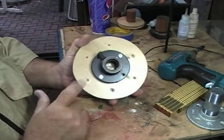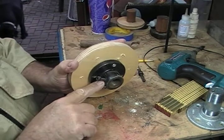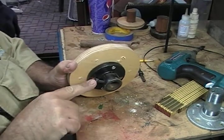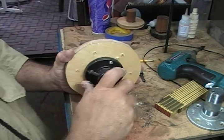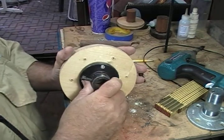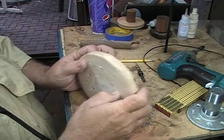The bottom half of the chuck starts with a faceplate that fits my spindle, which is 1-inch-8 on this lathe. I drilled a hole in it, tapped it, and put a set screw. This is important because when you're running out of round, if you reverse, you could just walk it off the lathe. You won't believe how messy that'll be.